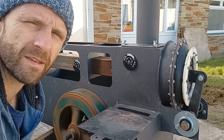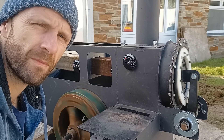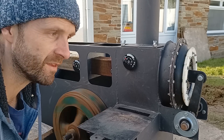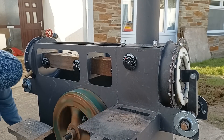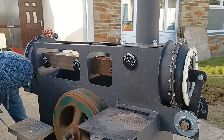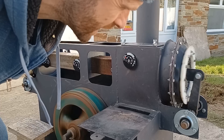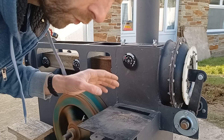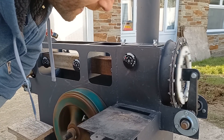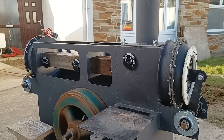Something interesting to note — Stanislav gave me this idea: if I apply a slight pressure to the non-return valve going into the engine, the slapping of the diaphragm actually stops. Now you can see the slapping stops because the internal gases in the engine are at a slight pressure. That might be a future modification to keep a constant slight pressure on it. As the gas slowly leaks out, the slapping comes back again.